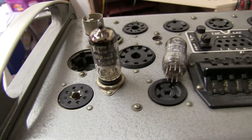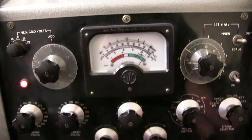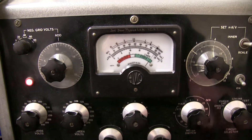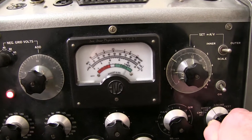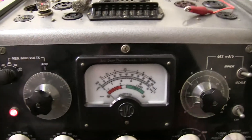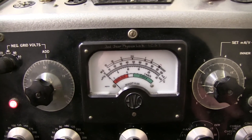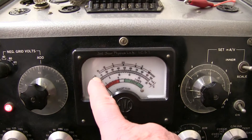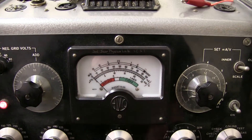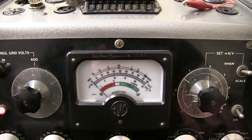That's a good Mullard valve, identical to the bad one. You check the heater — it was just heating up — and check the heater insulation, so no short circuits. The good one is just rock steady, very very high mega ohms, almost hundreds and hundreds of mega ohms, no leakage at all. So that's the good one.